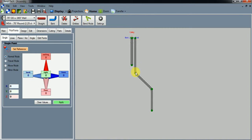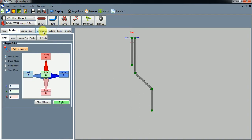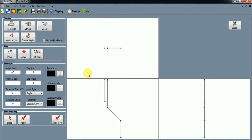Go to Display and you can kind of see the profile of our stool. We're going to have a little separation between the one-inch all-thread and the three-quarter inch tubing in this profile, and then the stool top up here to sit on with casters down at the bottom. Let's go into 2D mode, Vertical, and make sure we're in the neighborhood of 27 inches — which is what we wanted. From the centerline of our stool to the centerline of one leg, let's go to Horizontal.